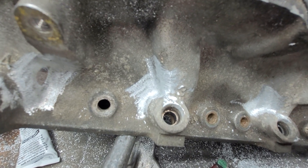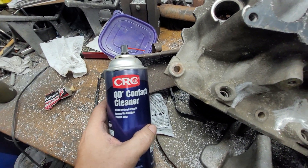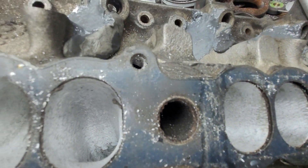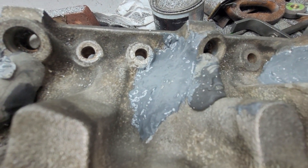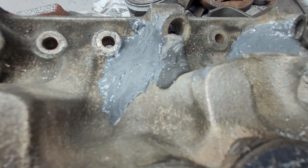I actually like the rougher texture burrs, and then you hit it with a little contact cleaner or brake cleaner to make sure nothing else is on there. I also put some clay dams so I could actually have the epoxy up a little bit higher, and I could shape it later.